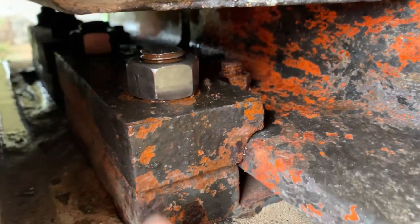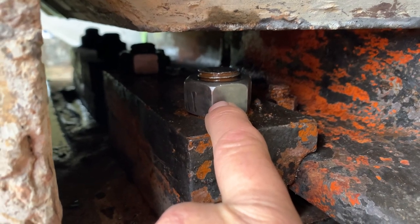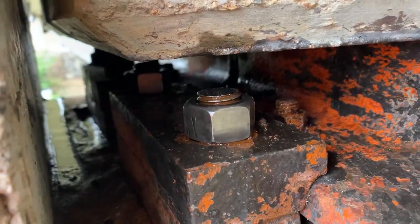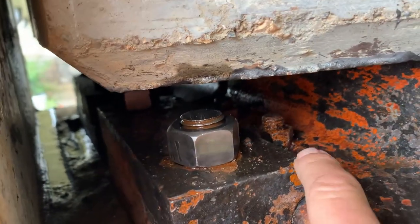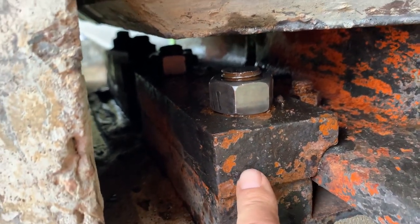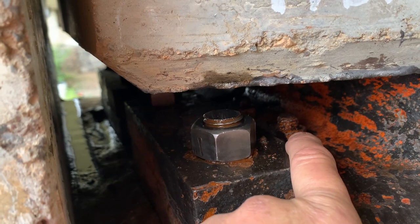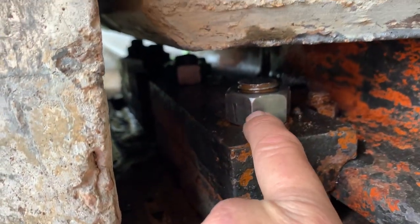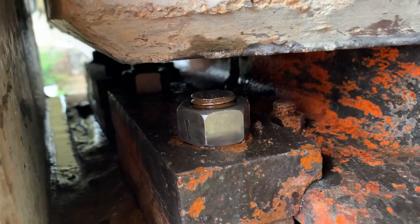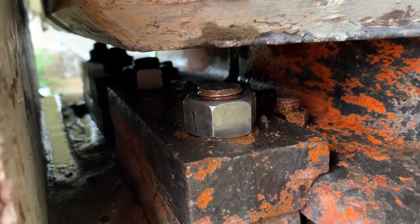Here at Eni Creek, the free end bearings have heavily rusted anchor nuts that we've replaced. We had to trim the top of the thread because there's just not the space to get the nuts off and put new nuts on. In order to get to the 5-8 threads for the sole plate, we have to remove these guides, but the guides physically can't be removed. So all we can do is estimate the metal loss — we can't even get in there and measure those properly. By replacing these anchor nuts, at least we're preventing that lateral movement, and that's the best outcome we're going to get for these end bearings. It's pretty much just the outside free end bearings on the outside.